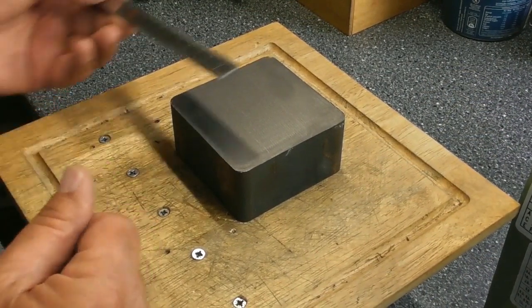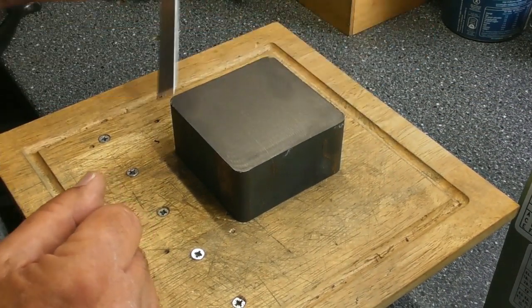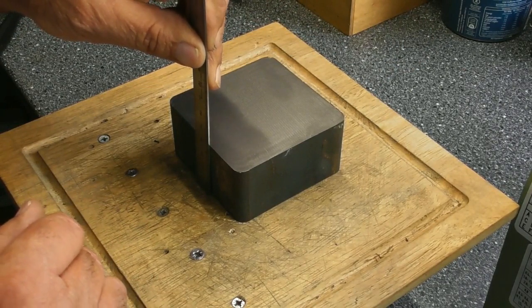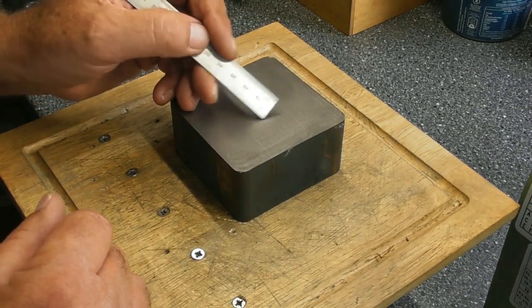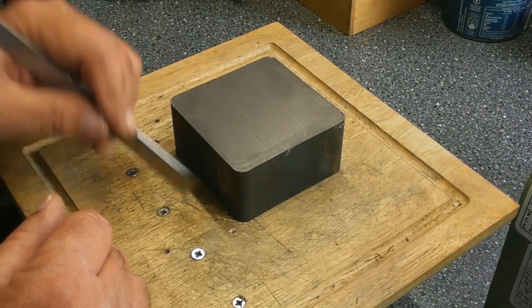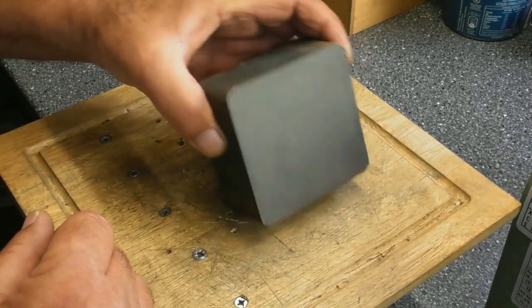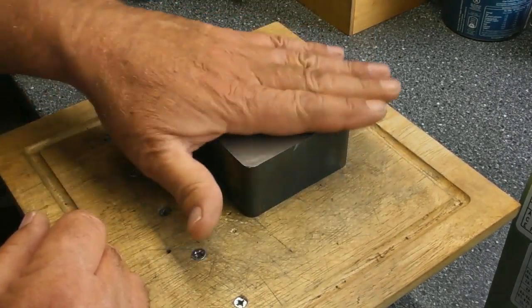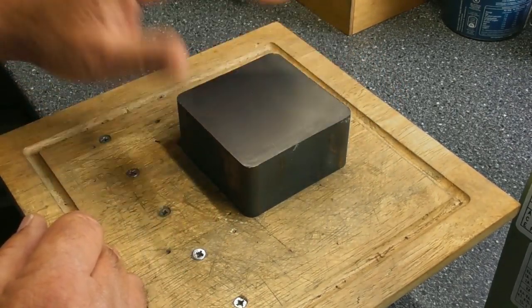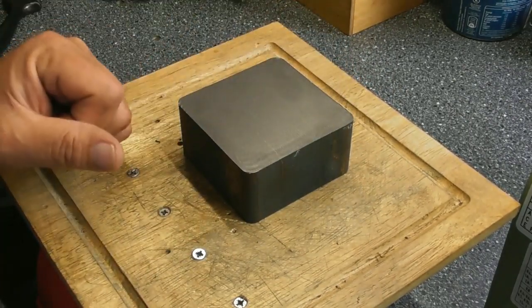Let's show you the material. My piece of cast iron has arrived and it measures up at approximately 80.5 by 80.5 and it's about 40.5 to 41mm thick. Finish size is approximately 35mm thick, but it will have a circular boss sticking up in the center, so I'm quite limited on the amount of material I can machine off. I think the first thing I'm going to do is get a flat surface. It's sawn cut both sides and it is actually fairly flat — not a bad saw cut, probably done on a quality metal cutting saw.